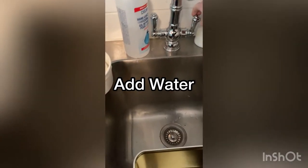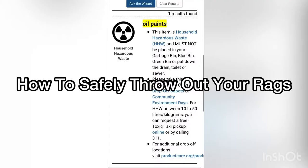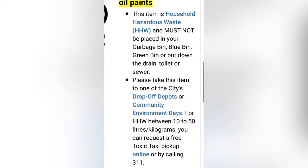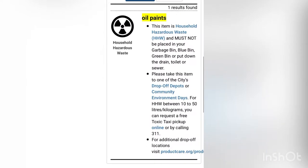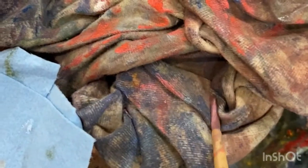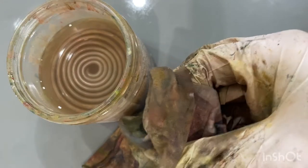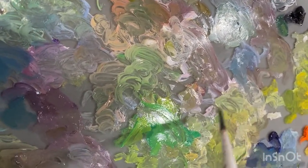The third thing to do is add water. Adding some water to the can can reduce the risk even more. The recommended advice for getting rid of these rags is to soak them in water, put them in an airtight sealed plastic bag for disposal in the household hazardous waste — not the regular garbage pickup. There are environmental and safety reasons oil paint is considered hazardous waste, so you'll have to look up your local municipality website to learn pickup or drop-off locations in your area and the waste disposal rules.